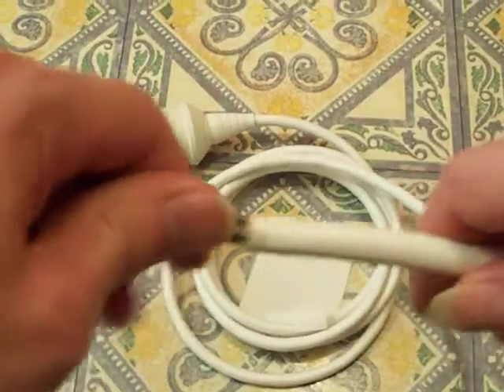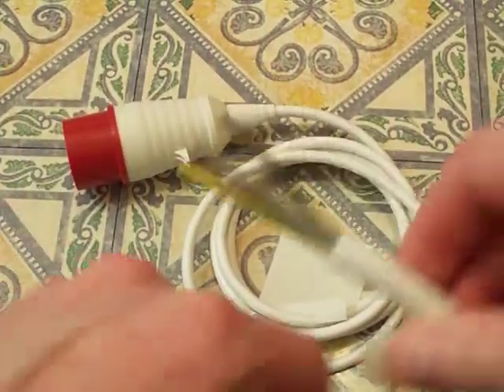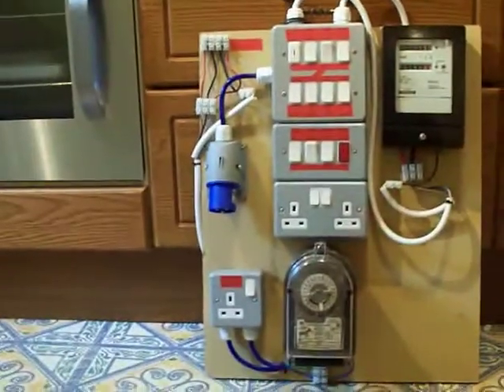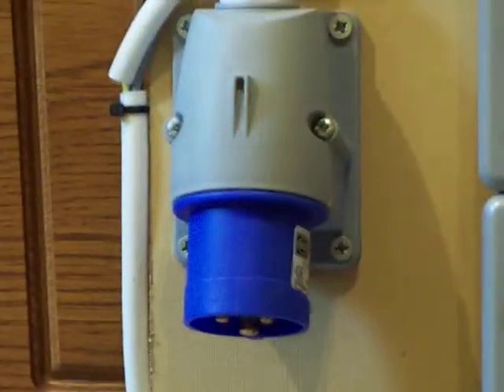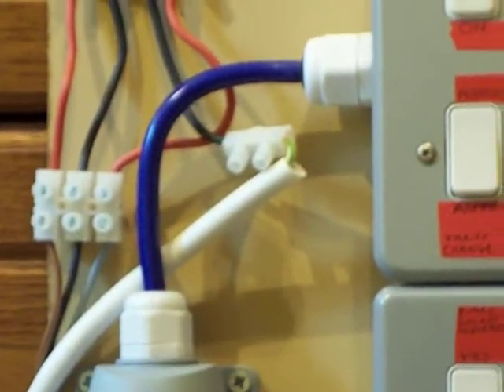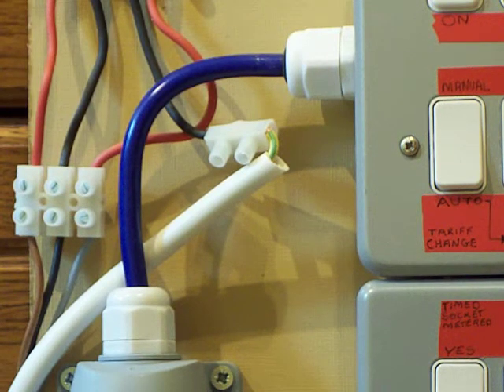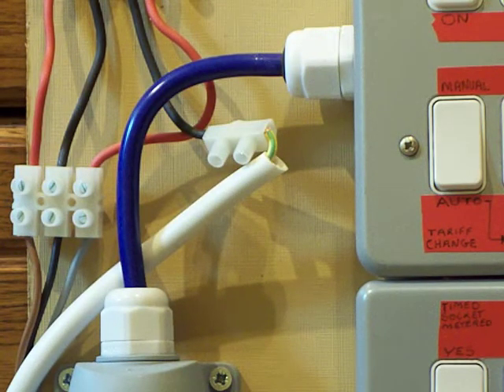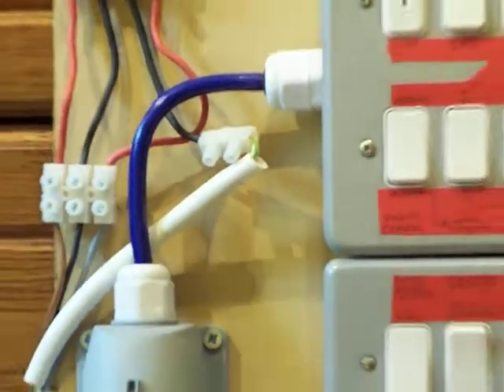So you've got phantom current between two cores and isolated 240 volts between the other two — that's how I plan to jig it and make that board compatible with phantom loading. All it needs is that appliance inlet removed and that small piece of flex that goes into the side of the control panel removed. I'll open up the stuffing gland on the side and put that four core flex in there, and that will make the board compatible with phantom loading.